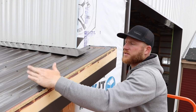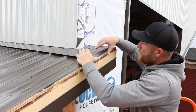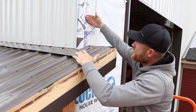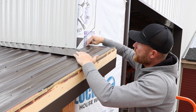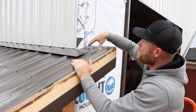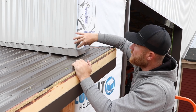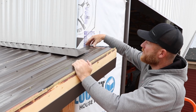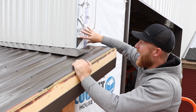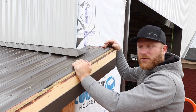So now hopefully this makes sense, because I've got this roof steel that comes up past the corner, and when I cap this with my trim details, all my water that comes off the wall here will get out over the flashing into this pan, which will run out and down, and then my corner trim will come down and cap all of this, make it look all good. And the most important thing is that this extends out past that, so I don't get that weird, awkward termination of my corner trim that really annoys me when I see it on other buildings.